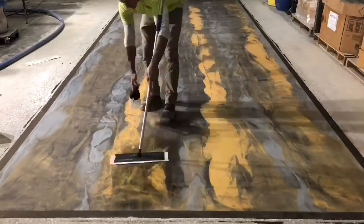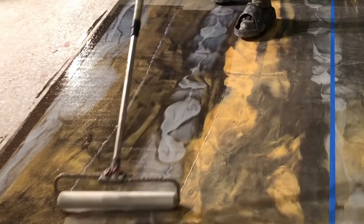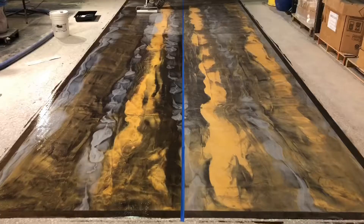To verify whether locking down the epoxy coating after sanding and wiping would affect the results, half of the floor was sealed with a polyacrylic sealer. The expectation was that sealing the floor would help the topical sealer lay better and address any porosity that might cause bubbles as a result of the sanding and wiping of the epoxy metallic.